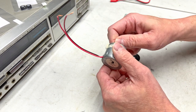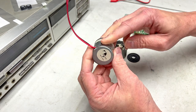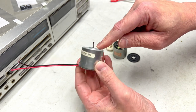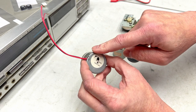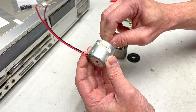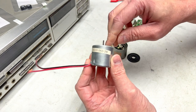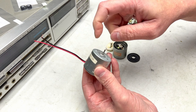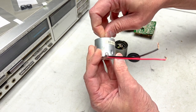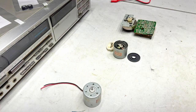So that's bad, but there was more than that. The mechanical side of this had a problem as well, because this was so high hours. Basically, when I took this apart to rebuild it, both the front and the rear bearings pulled out of this thing. So, yeah, it didn't go back together quite as well as I would have liked it to. It's got a wobble in the shaft now, so, yeah, that's not quite the best result from this. So, yeah, that's that one.